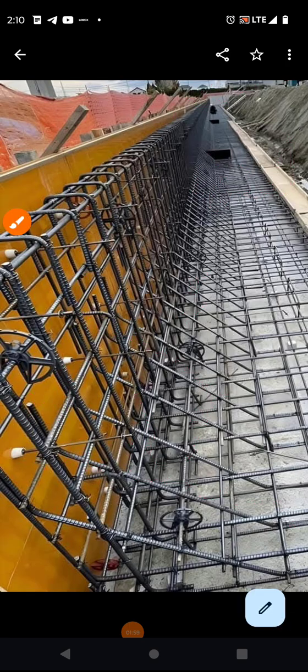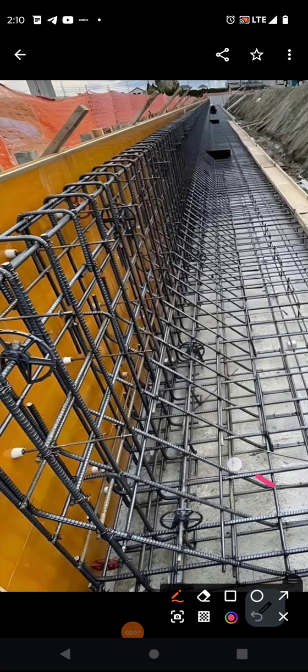If you look at the reinforcement I just showed you, that roughly 45 degree stuff, which is here, it's on the rebar that's in the back from our view. And that's the compression side of this rebar. That is when the wall is experiencing an overturning force. That rebar that's here is in compression. It's not quite useless, but it's not helping with the overturning, which would be more on this side.